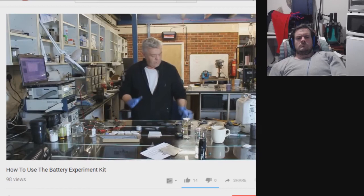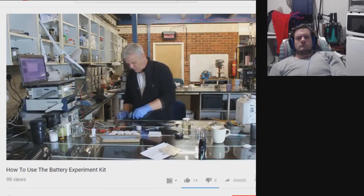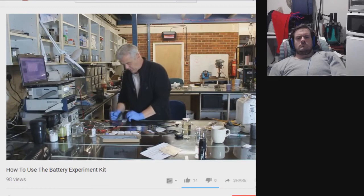And again, you can see how to do that if you look at supercapacitors 101, or if you have a look at the video on supercapacitors, we go into much more depth on how to make a supercapacitor. What I'm going to do is just make a quick and simple supercapacitor here, which is a dual carbon supercapacitor. It's the same carbon on both sides. I'm going to cut out a little bit of cell guard. That can be my separator. Put that on that. And that's my supercapacitor. It's a symmetric supercapacitor because it's two types of carbon that are identical on both sides.